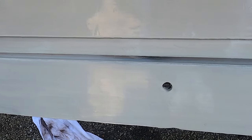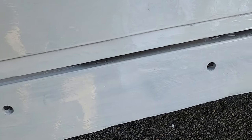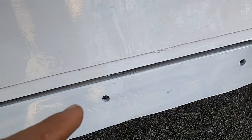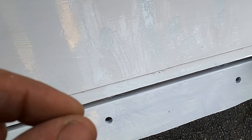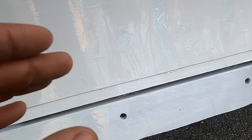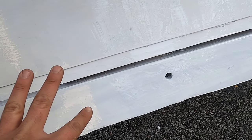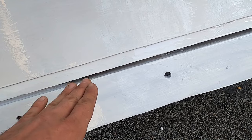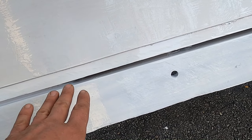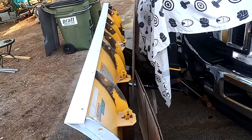We got a coat on the joint right here, like I was showing you. Now we can leave this open, and as it dries, we're gonna have a good application of paint on both sides where they meet, and then when they pinch together, it'll prevent any of the paint from chipping, as opposed to if we had this trip edge closed and just painted the edge, there'd be an inside edge there that wouldn't have any new application of paint, so it would start rusting quicker. So we did the top here too,